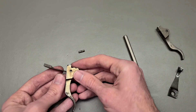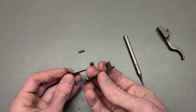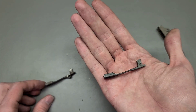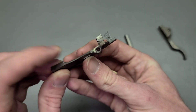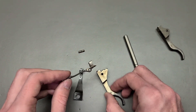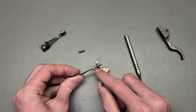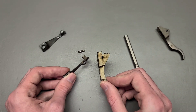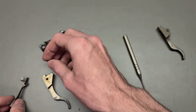This is why you need to be careful. The M27 trigger has a special sear and a special trigger spring - this guy right here. Notice the difference: this is a standard garden-variety Mosin-Nagant trigger spring, pretty much all of them have this identical one. This one is unique to the Finnish M27 rifle. There's one big difference: this guy has this extra hump of metal with a hole through it. When you're buying one of these, you need to make sure that the M27 trigger comes with this special sear. If you don't have this sear, this is going to be basically almost entirely useless.